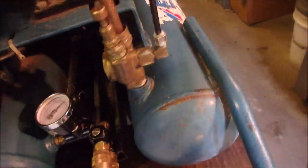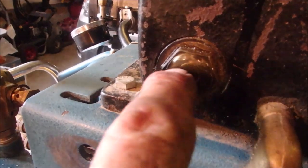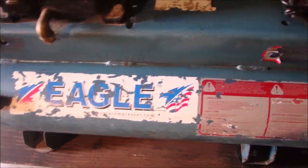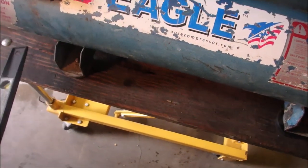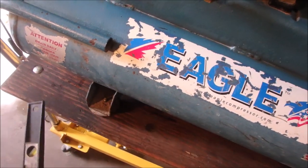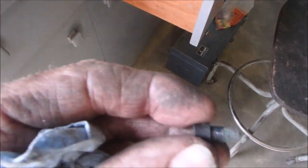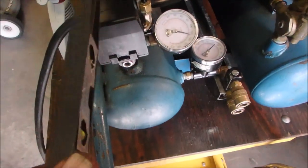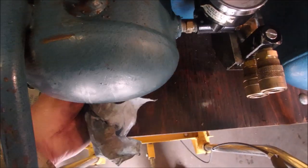I'm going to pressure it up one more time. We still have to do the oil in the compressor, but it has oil — it's about there, I think. That's not much oil either. So we're going to let this sit overnight, but I'm going to charge it one more time. We cleaned it up a little bit, put new feet on it so that it has just a slight drain to the bottom valves. We readjusted the switch — it had a terrible plastic adjuster on there which was stripped out, so I took a fine thread SAE and stuck one in there. It seems to shut off and turn on at the right amount. It turns off at 130 — I like that for an older machine.